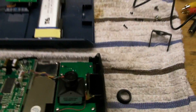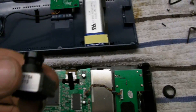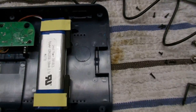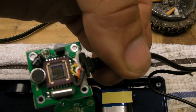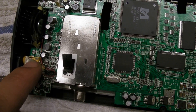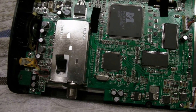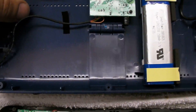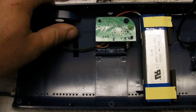Changed it up — got this portable TV that already has a case and everything. I'm going to try to fit this little camera in there, drill a hole — got it marked already. I'm going to run all the video shorter because it has these big bulky plugs on it, so I'm going to tap right off the video input for AV. I'll mount those infrared LEDs right in this area here.